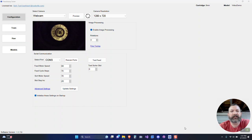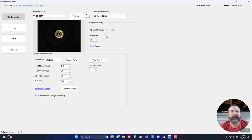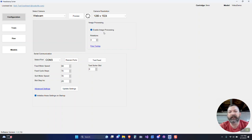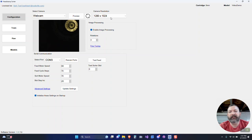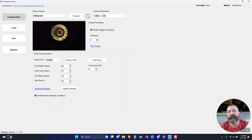Some of you might ask why not go with the highest resolution — 2048x1536 — since the picture would be amazing. However, we have to scan all those pixels and crop out what we need, and that many more pixels significantly increases processing time. Ideally we want the smallest image possible. At the end of the day, these images are being cropped down to 220x220, so all the extra pixels don't actually help us. That's why I arrived at 1280x720 — it gives a good picture at the minimum practical size.